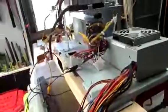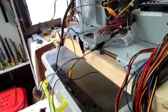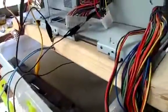But that foam that's building up in there, that is hydrogen gas. Don't let it build up too much, because if one of your power supplies arcs over or something, it will ignite, and you don't want it doing that. If these ends were enclosed and it was to fill up with hydrogen, and one of these was to blow up, it'd probably send this whole lot flying straight up through the roof of the shed. Even the DLP chassis and everything would go up. It's not something you want to have happening. In fact, what I am looking into trying to get is some clear flex pipe, Plastiflex I believe it's called, just to run up over there and down outside with an exhaust blower at the end, just to vent out some of these gases and things. But it's working alright at the moment.